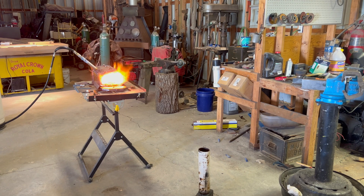I want to get the whole inside of that forge up to temperature so that once we put the knife in we can regulate the heat and keep everything constant. It's been about five minutes, inside of that forge is looking pretty consistent, so I'll turn it down, put the knife in, start bringing her up to heat, find that temperature we want to stay at — and then about 30 minutes later we'll get the smoke show started.